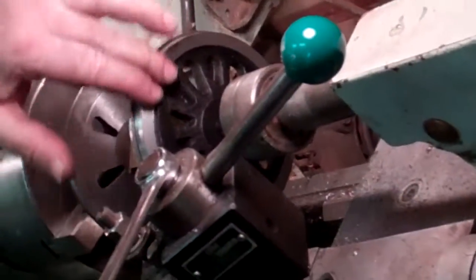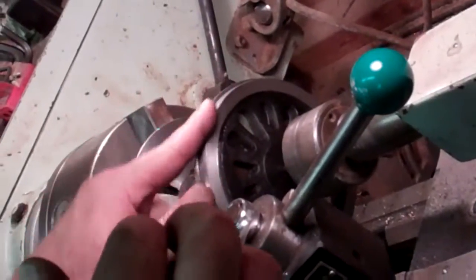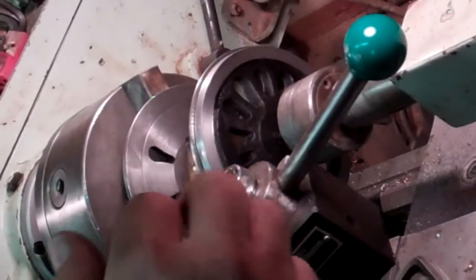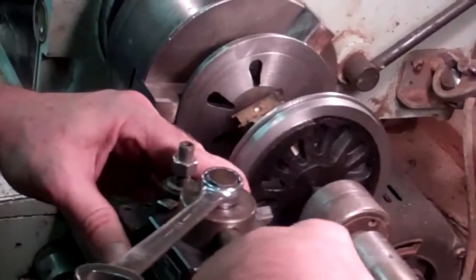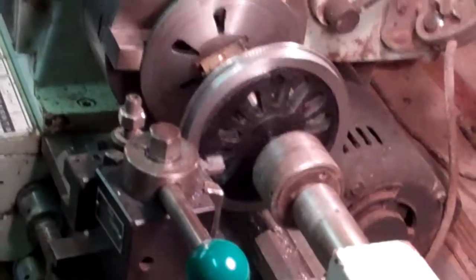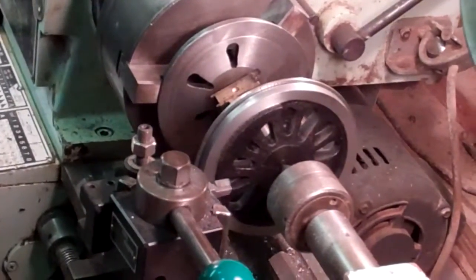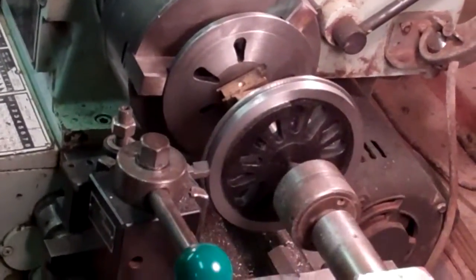Now that's pretty good. This face of the wheel is more for aesthetics than for actual functionality, but this surface of the wheel rides on the rails, so this has got to be true and at the correct angle. I'm going to adjust my tool a little bit so I can make a proper cut with this. Lock it in. I'm going to use the cross slide feed here to do the four degree angle — this is set to come in at four degrees.